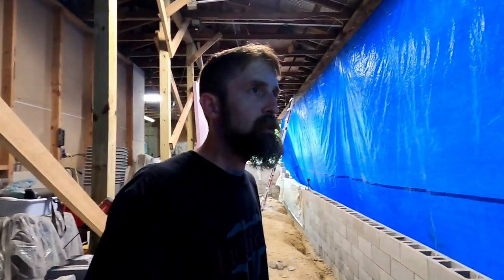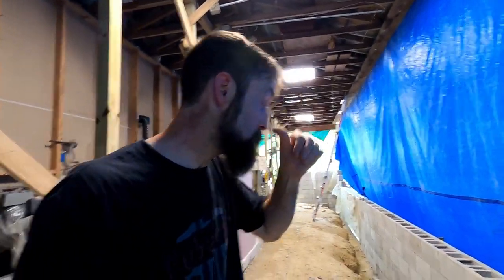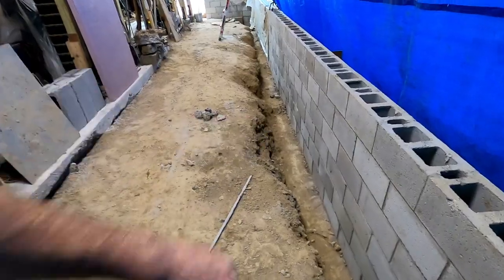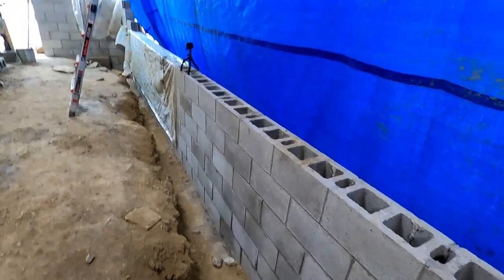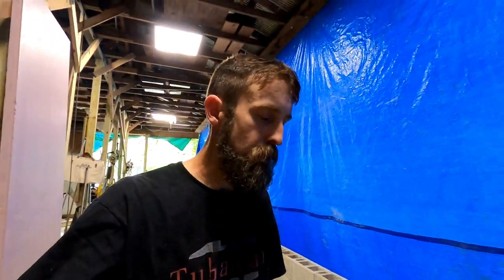And me erring on the side of caution, on the large side, I got 7.82 yards of flowable fill. A truck only holds 8 yards, so hopefully, this will be enough to get this to the level that I want. As you can imagine, calculating how much liquid volume you need to conform to this trench is not an easy thing to do. It's impossible, really, without filling it with liquid and measuring the volume. So, educated guess it is, and I think that it'll be plenty.